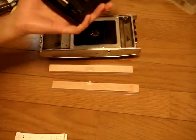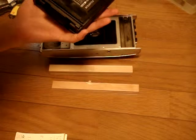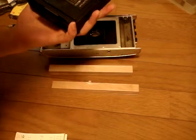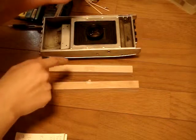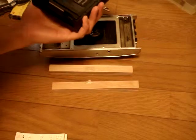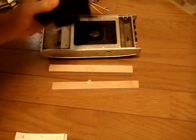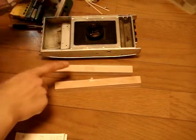The 0.05mm tolerance is probably not achievable unless you have a milling machine or something, so I'm just going to say 18mm roughly. That's going to be the final spacer thickness. Once this mounts on there, it will provide the extra 2.3mm and boost it up to our 20.25mm. So we just need to get these spacers to the right thickness now.